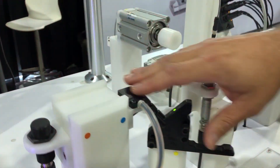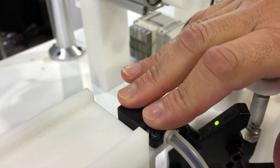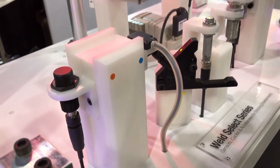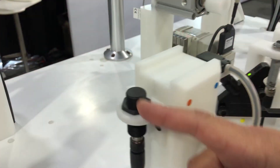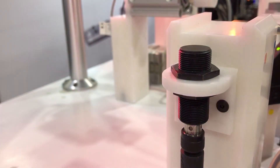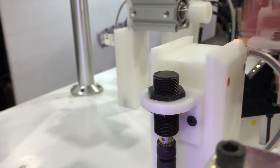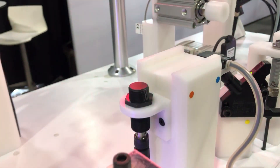We can show you an example of a flat-pack steel face sensor with weld-field-immune and factor-one circuitry. We have the silicone tubing to combat the type of weld spatter that is common in a MIG welding application. And then our go-to barrel style sensor has the Sun73 protective ceramic coating — a very good coating that deals with weld spatter and actually has a thermal barrier up to over 450 degrees to keep it from burning through the actual coating.